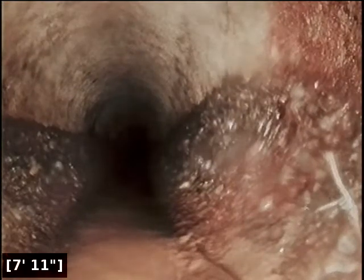We're about 8 feet. The line appears to transition into concrete. Here at 71 feet, it does appear that we have reached the city sewer main. We're going to turn the water off, let it drain, and then start with our backwards inspection from here.